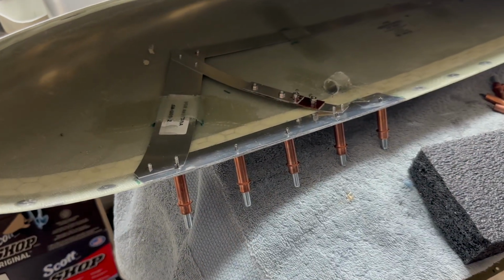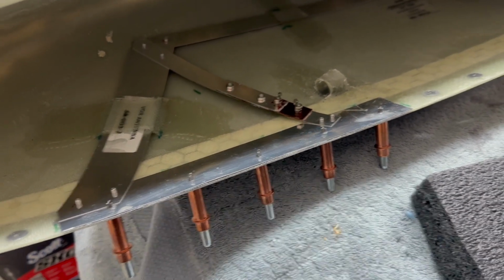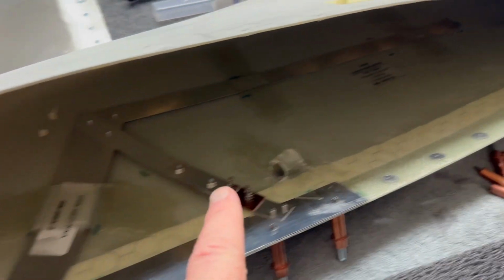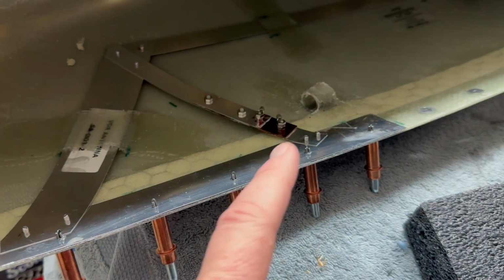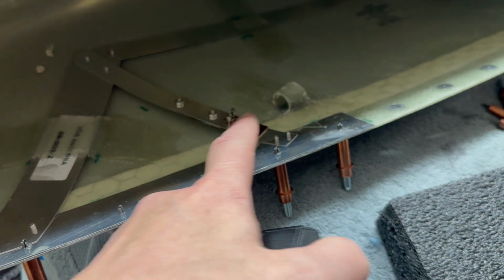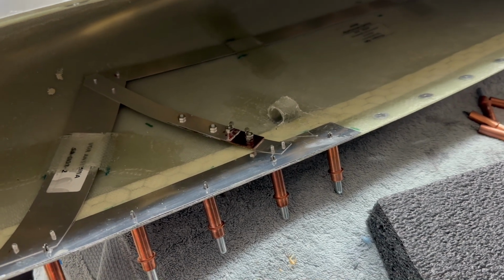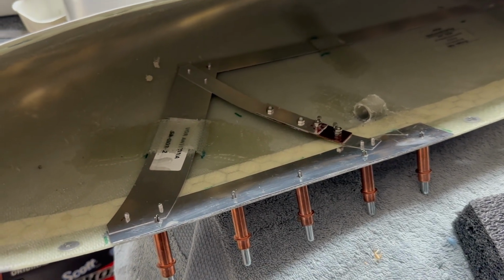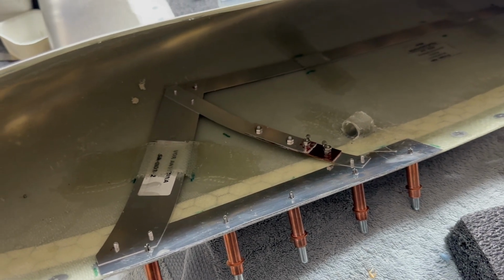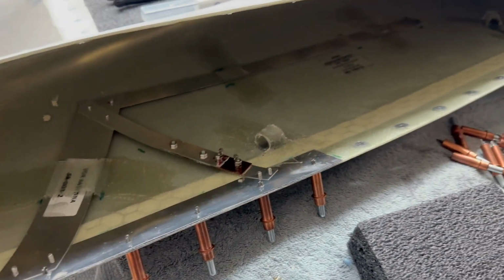All right, y'all, we did some fiberglass work over the morning and really secured in the Bob Archer antenna. So we did some lapping on 3 points on the antenna itself. And then I just created a little loop here as well. And that loop is gonna help hold that antenna cable in place also. And for that, we just used some West Systems. They make a boat repair kit, and that has the resins in like pre-measured things. It has a cup and all that kind of stuff. And that worked out super well.